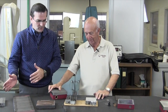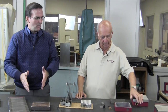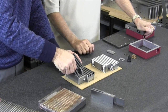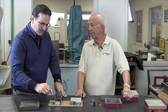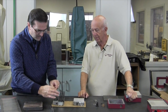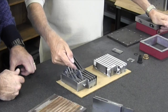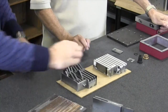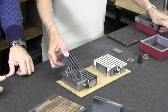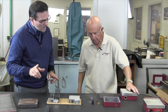Now our top plate is just about ready; we move on to building our magnet box, which is laminated of mild steel and permanent ceramic magnets. When you put these magnets in, they have to go in north, south, north, south — every one has to be oriented so you're getting the correct polarity in the proper sequence, alternating all the way down. The north and south poles on the sides transfer through the magnetic poles into the top plate. The thicker the ceramic magnet, the more strength you're going to get.